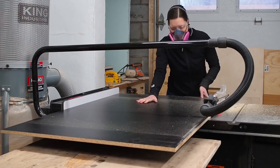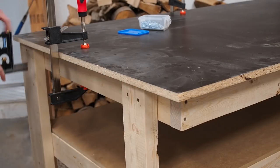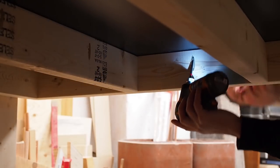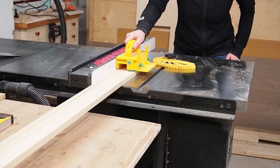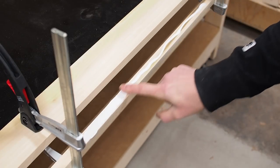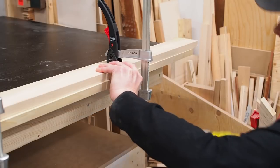I cut the top so it would overhang the frame on all four sides, because I know I'll end up using this as a workbench and I want to have the flexibility to easily clamp stuff down. After checking that the overhang was even on all sides, I used pocket screws to attach the top from underneath. Since this is quite an awkward position and hard to see, I finished driving all the screws by hand so I wouldn't overdrive them. To hide those unsightly melamine edges and offer some additional protection, I'm going to trim the edges with some poplar. A hardwood like oak or maple would be even better, but for some reason I really like poplar and it's a little more affordable. I applied a generous amount of melamine glue and temporarily secured it with a few brad nails.